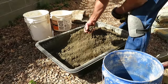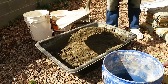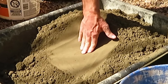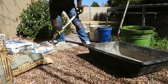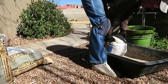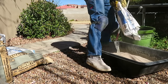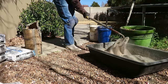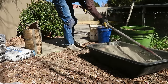This is what the dry pack mixture looks like — it's a combination of sand and Portland cement with just enough water mixed in to cause the cement to set up. When you compress it and then trowel the surface, you can get a very smooth finish that dries very hard and can have tile set on it. The recipe I use is one part cement to four parts sand, with my shovel as the measuring cup. You don't have to get it exactly right, but stay close to that one-to-four ratio. A 50-pound bag of sand gives me about six shovelfuls, and in my mixing pan I have three parts cement and 12 parts sand — enough to do about half of a four-by-four-foot floor. I'll need to mix one more batch for the whole floor.